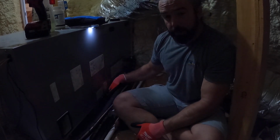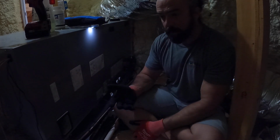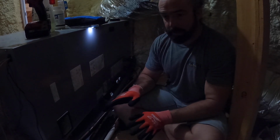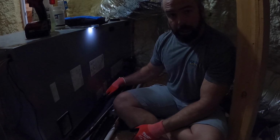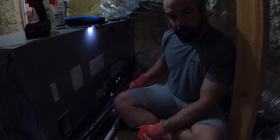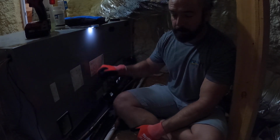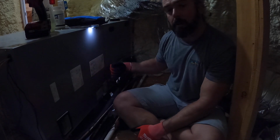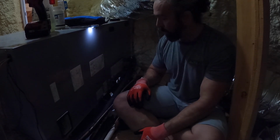Code does not require float switches, but our whole goal as a company is to make sure we provide our customers with a better experience and as much or as little downtime as possible. So we would rather you have a blank thermostat, which is how we wire up these float switches to just make the thermostat cut off, so you immediately know there's a problem before we saturate the bottom of this unit, have it overflow out, come out of a drain, and possibly damage your ceiling or flooring.